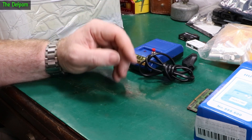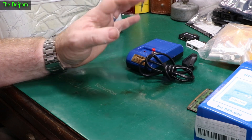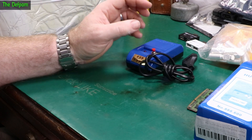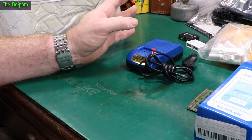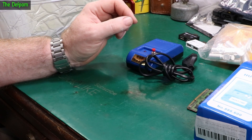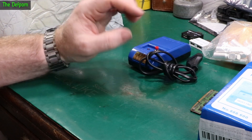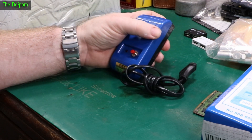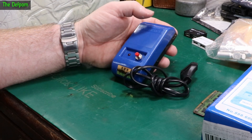When I was doing my testing on it, I had a chance to recalibrate whilst redoing the firmware. I verified that yes, it is actually out of calibration, and did some work on it — tweaked some pots inside to do some tuning, then recalibrated the reading. So it's actually reading correct values within a much closer proportion. It was about half an amp out before. Now it's least significant digit, couple of digits — it's much closer. The problem with clamp meters is they're never particularly great anyway, but it's way better than it was. But part of it is that clamp meters can get magnetized, and when they get magnetized from doing readings, it can affect how they read.